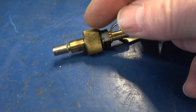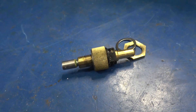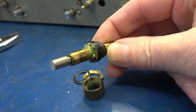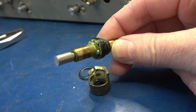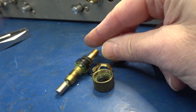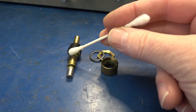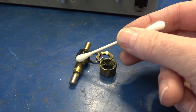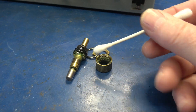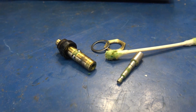Same deal — just undo the little knurled head, clean the inside, re-lube, and put it back. You can see by looking at that lube it's pretty dried up. It's always a good thing if you can get to these and clean and lube them before those balls chew up the insides and destroy the vernier. I've got lacquer thinner on a Q-tip to remove the old lube, then we'll put in the Deoxit L260D.